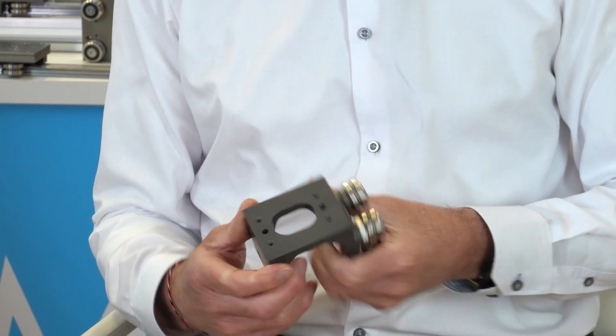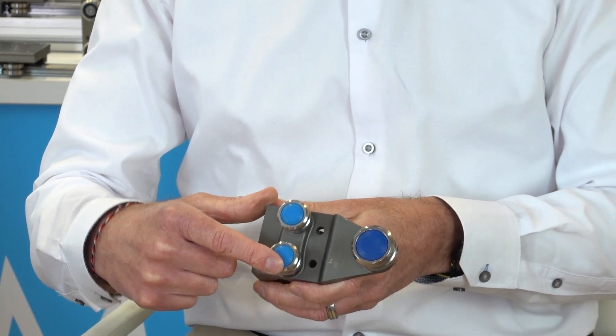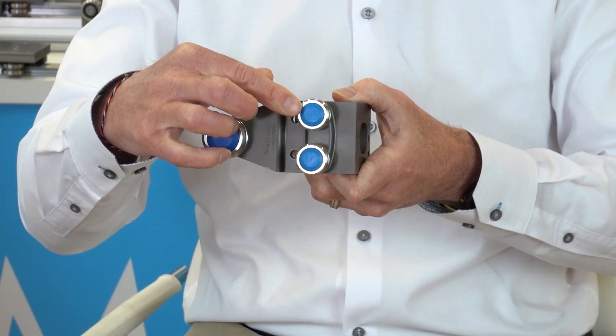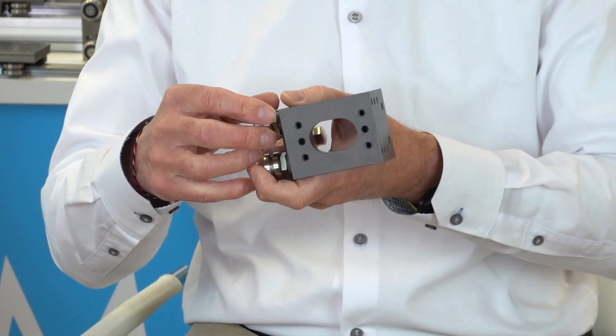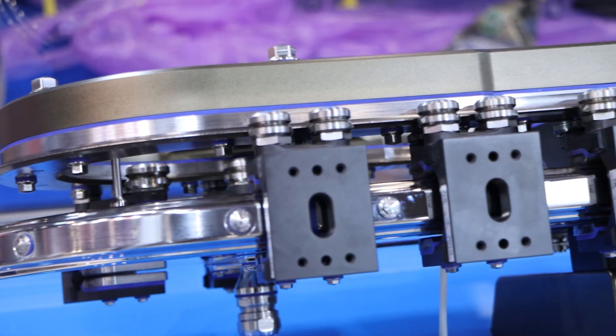The next level up is the GFX wash down system. It features an aluminium body with a hard anodized finish. The bearings have a sealed arrangement — common across all ranges — designed to keep water ingress out and keep the food-grade lubricant sealed in. There's also a large cutout to make cleaning easy by reducing dirt traps, and the base plate and body feature cutouts to allow easy clean-down as well.